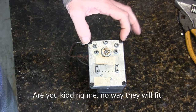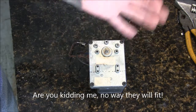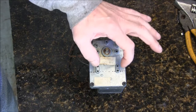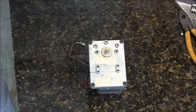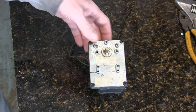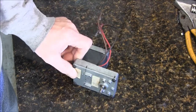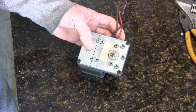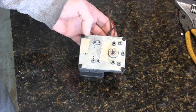I'll have to make a little spacers for these. The original four mounting screws for the case feeder — two will go in there, two will go in here. They're 8-32s. The Hornady's are 10s, so I guess I'll just get some new screws. I don't want to re-tap these.